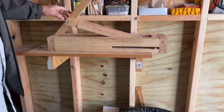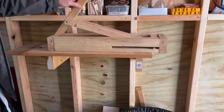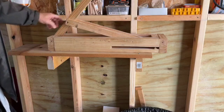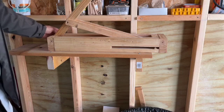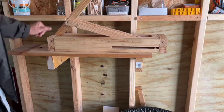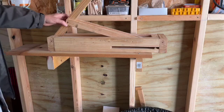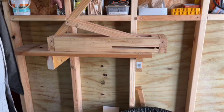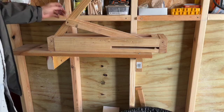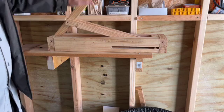You can put a pin or a screw in here — I might change this to a screw. I haven't had any problems with it sliding out. The one down here can't slide out because it's a real tight fit, but if it did I can put a cap over the end of the wood or just put a screw beside it to lock it in place. Same thing here — take a small screw and screw it right at the edge so the dowel won't slip. Then you can remove it and punch it out if you need to replace a member that breaks.